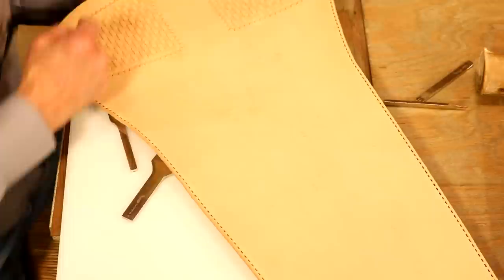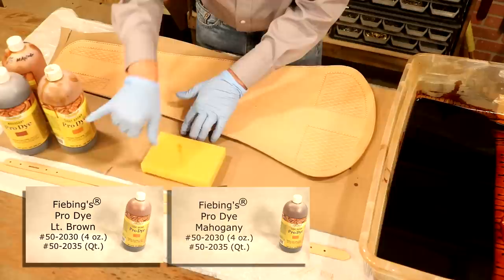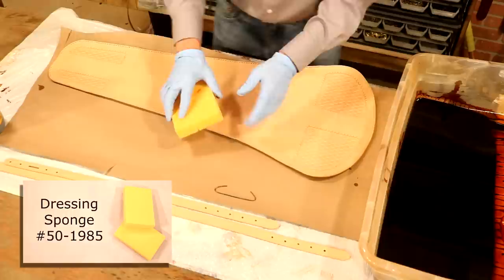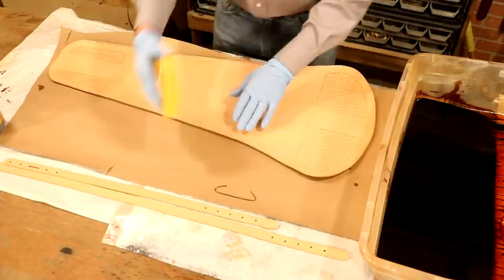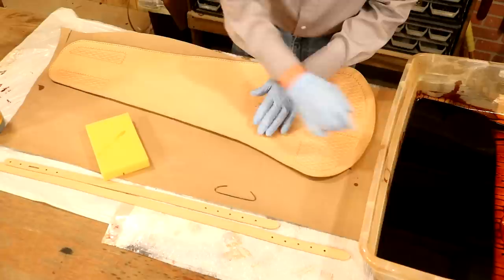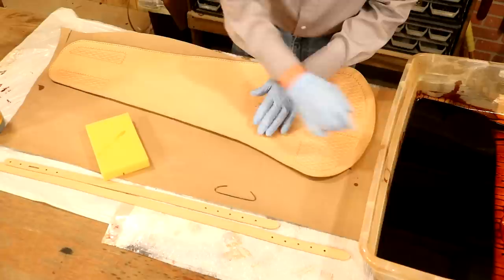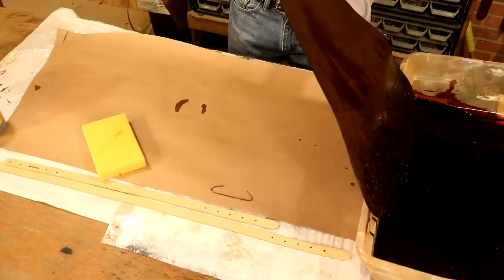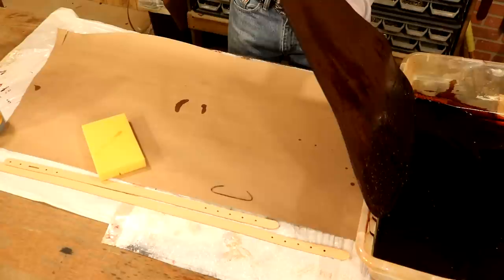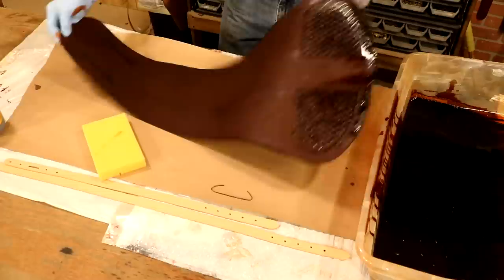Let's step over to our main table — we're going to add a beautiful dye and a top coat. We're going to go with my favorite dye color, actually a mix: pro dye mix, 50-50, light brown and mahogany. I like it so much I keep a mix in my shop at all times. We could apply with a sponge, but it's going to be tough to get this consistent because we'd have to apply on the face, flip it over, apply on the back, and just hope we don't get more dye back there. So we're going to dip dye. The downside: we're going to need a good bit of dye. But if we go with the quart and do a 50-50 mix, we've already got enough. Let's run this through easily and let the excess drain off. With a rag, let's just mop up any excess.